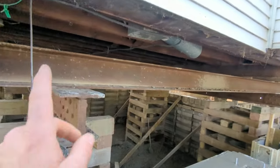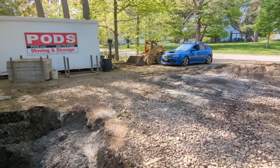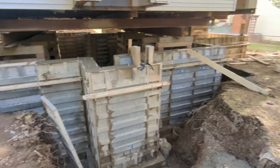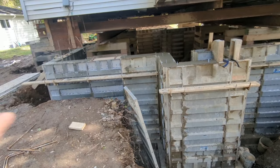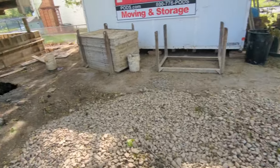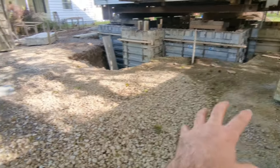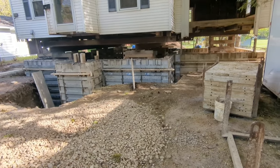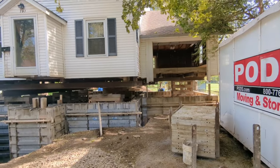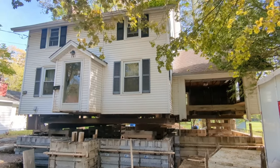Once they strip the forms and are long gone, I'll crawl around on the cured top and make sure nothing's sticking down from the old sill — just little inspections so when it comes time to set the house down there are no hang-ups. Then we start chipping away at everything else: getting gas, water, and sewer rebuilt into this space so we're done outside and can backfill with confidence. Get the downspout loop in, finish the backfill, rough grade, put down bank run, maybe some seating. I'm getting excited — not even done with this portion yet, but I'm already ahead of myself. Thanks for watching.